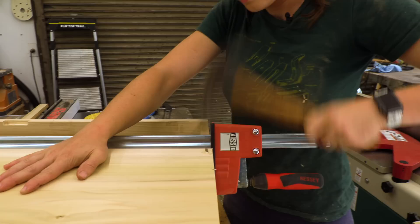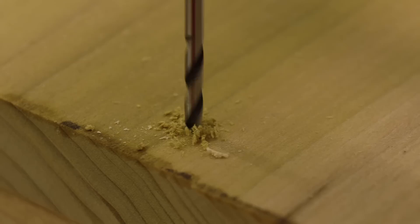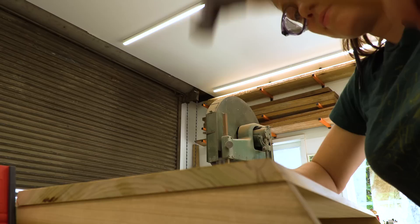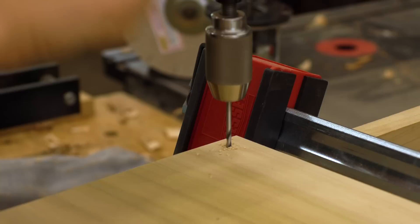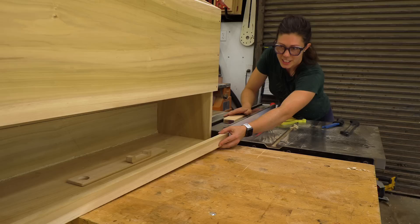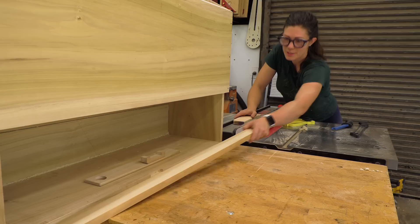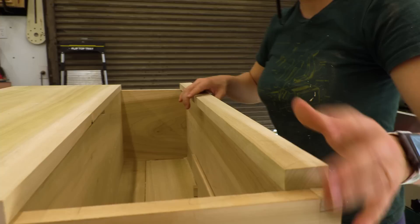Don a little hearing protection. We're going to come back and use a nail set to set those later. I'm going to try to go a little bit further down because I don't want to split this wood and have a visible split there. Now it's nicely in place — that's perfectly flushed there. So now we basically just need to secure it in place with the rest of the nails. The next thing we need to do is make a little catch for the front of the fall front. So you just need to rip that down, then nail this on.